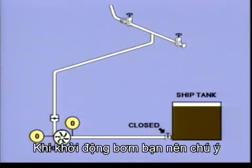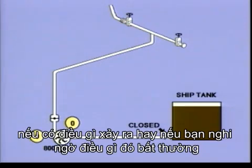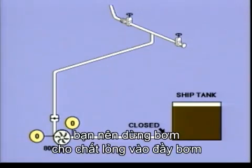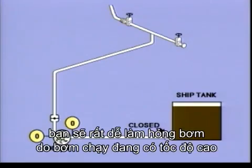When you start the pumps, you should really be on your toes. Have people watch out for leaks in the pump room and on deck. Check the pumps for vibrations, leaks, and abnormal sounds. If something should happen, or if you think something is going wrong, don't hesitate to reduce speed or stop the pumps. If you speed up a pump and find you've forgotten to open the tank valve, stop the pump, then fill the pump with liquid, then start the pump again. Just opening to the tank will most likely totally wreck a speeding pump.